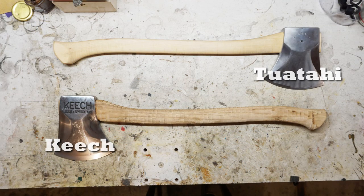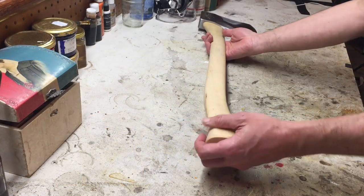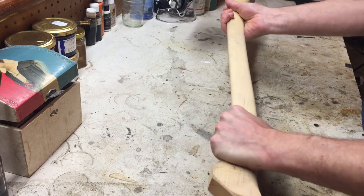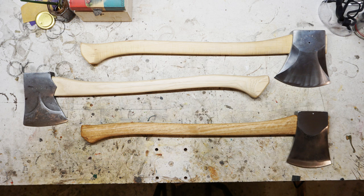I like the shape even more, and here's why. If you remember from the Efficient Axe series, we had a lot of discussion about straight versus curved handles — lots of pluses and minuses on both counts — but there is a kind of hybrid solution we can look to in racing axes. These two racing axes show how this racing style is basically straight, with a small ergonomic curve at the palm swell. I've heard this style called a Tuatahi style handle. While they are quite thin side to side, they are pretty thick in the chopping plane for extra strength and power transfer, and they are shorter, around 30 inches, as racers prefer. Some of our work axes will have this style handle, including our High Test Challenger mod. They are very comfortable and can help accurately swing a larger sized head for more power. The whole work axe idea comes from people's personal experience with their favorite shorter, lighter felling axes, and I like to see how much of that is really just the shorter handle — because what we're looking for is essentially what racing axe handles are designed to do: maximize power and accuracy. Maybe the key is really in the handle.